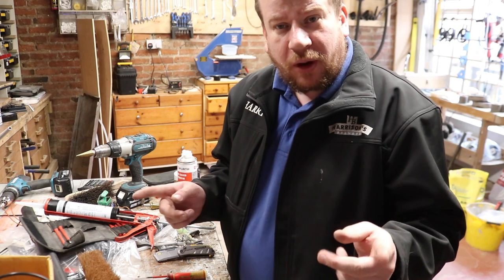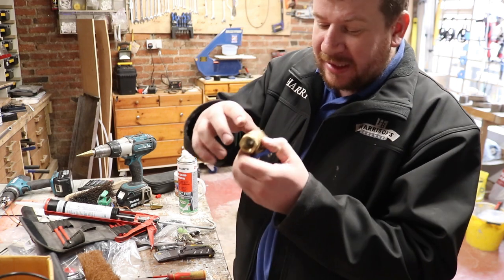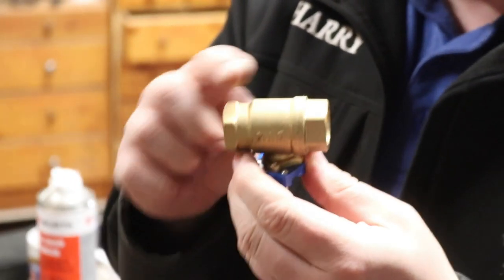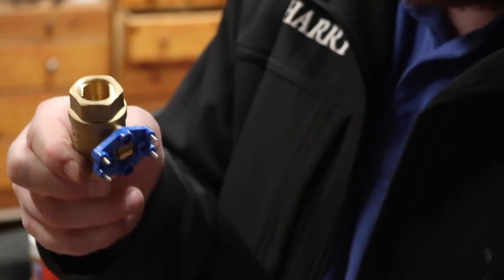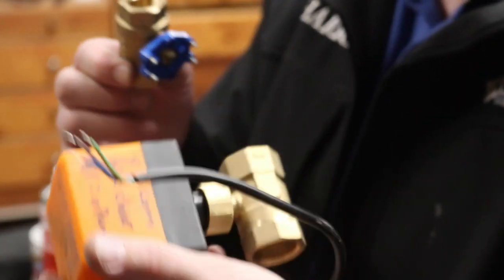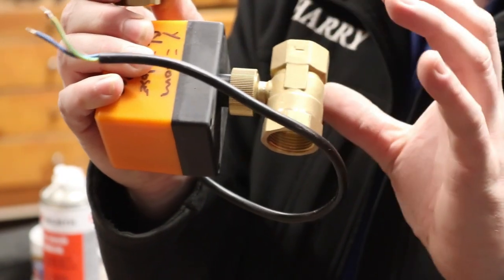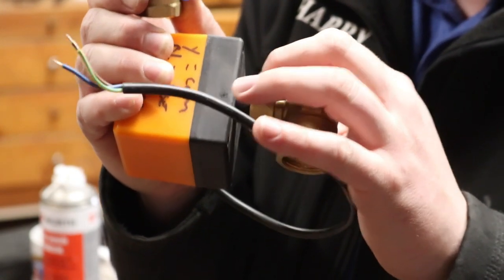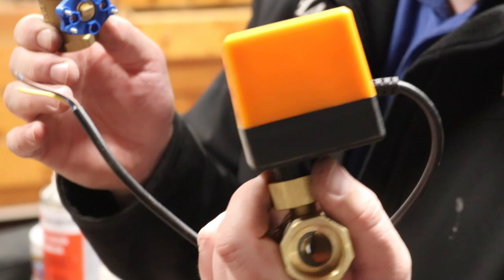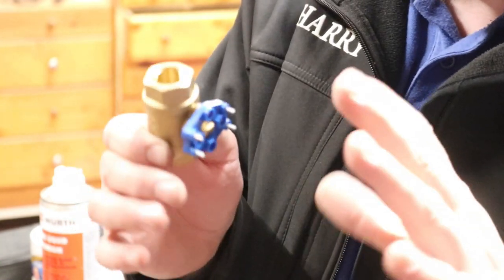All but one was opening. This is a brand new valve body. This is what I use for the motorized valves — we're slowly but surely upgrading to these ones, which are much easier to interchange by just undoing this nut. We can change the body if the electronics fail because these brass valves will last for decades. The trouble is these are three-wire, so it takes just a little bit of fiddling on the electrics.